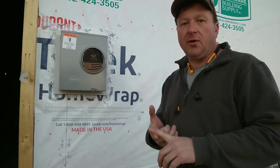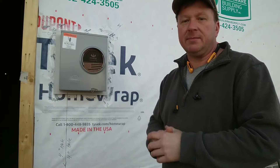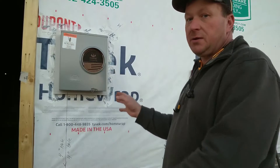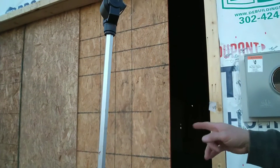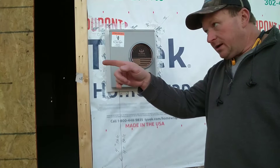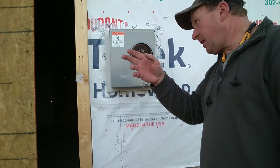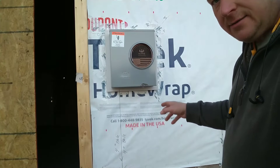The framing is done before I ever get a call to come out and look at the job and give an estimate on wiring the house up. Looking at locations on this particular house, there's a location toward the back of the garage, which is approximately 35 feet further. That would make every single home run going into this premise 35, 45, probably 50 additional feet longer than this location. This location seems to be the best.